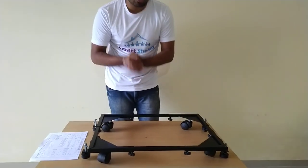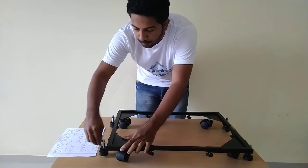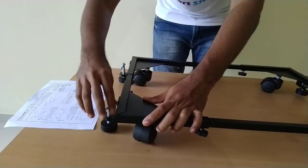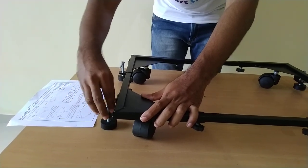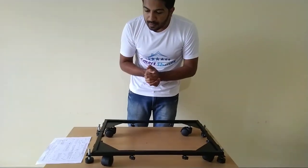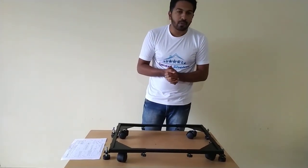The role of these rubber stoppers is to absorb vibration when the machine is in operation. When you operate the machine, just make sure you lower these stoppers so that they touch the ground. You have to do this for all 4 stoppers, and then run your machine. The machine's vibration during operation will reduce drastically when you do this for all 4 sides.